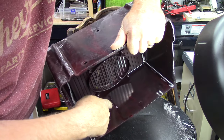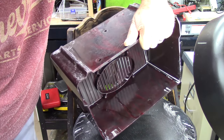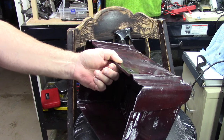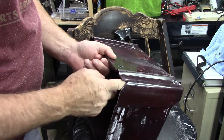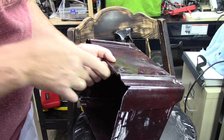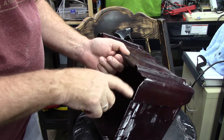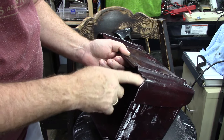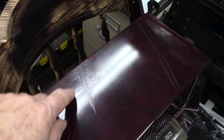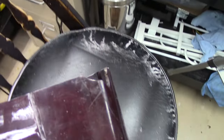There's a little bit of a bubble there when I'm doing that flexing. I might add a little bit more on top, flexing it a little more. And then — I didn't notice it before — but this back corner right here has got a chunk out of it and it's cracked. I just got through washing this, so there's water in there. I'm going to take my heat gun and hit that to evaporate the water so I can put some super glue in it, then get a former on this and see if I can get some tinted epoxy in here to form that back. I went ahead and ran super glue on the inside and outside of these cracks, and I've still got to put together some epoxy for this.